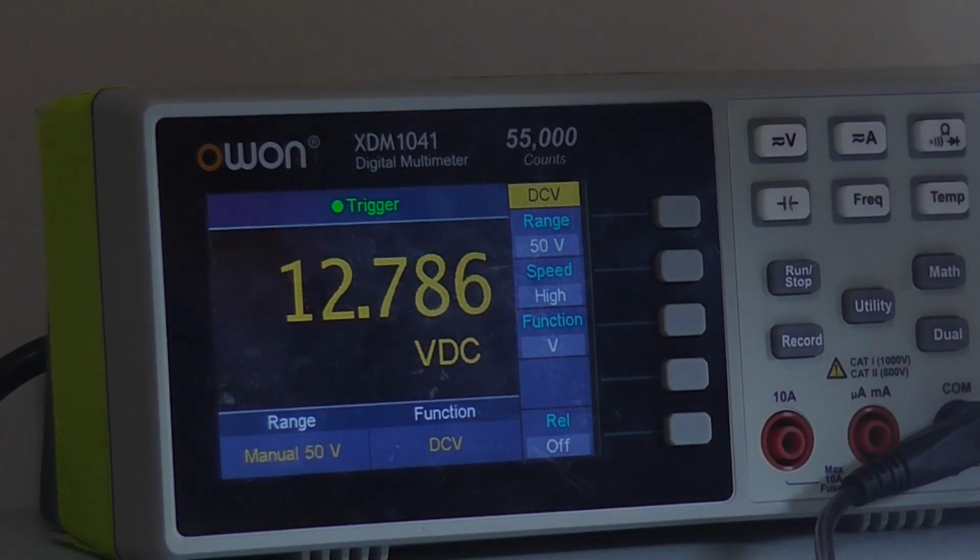Now I'm going to load this with a relay, because this is what it's going to eventually be powering. I'll explain before I close the video out of what I'm doing here. So I'll go between ground and the positive output, and the relay turned on as the voltage did not drop down. That's about 44 mA on that. So that's fine. Perfect. Alright.